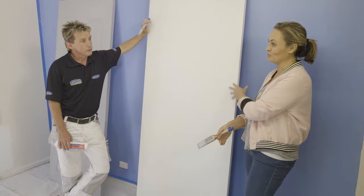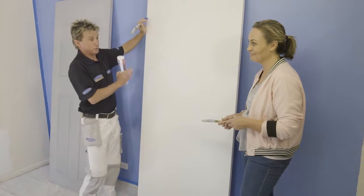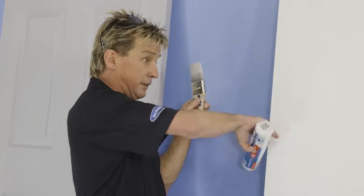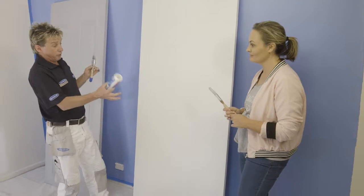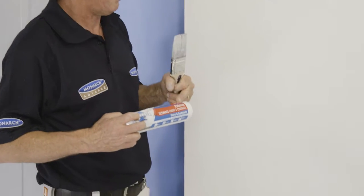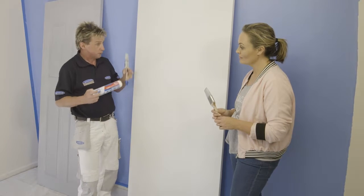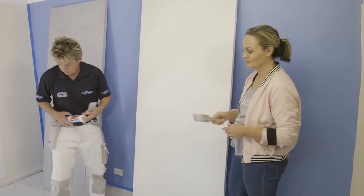So we've painted the panel door with all its texture — quite easy really. Now we're going to paint the flat door. Everybody thinks flat doors are easy, but in fact they're harder because you have a bigger surface area. We use a quality brush for the two edges and along the bottom, cutting in, and then to roll the whole face of the door we want a quality roller — I love using a 5 mil nap roller that says 'doors and cupboards' on it. It's designed to hold minimal paint for a nice smooth finish.